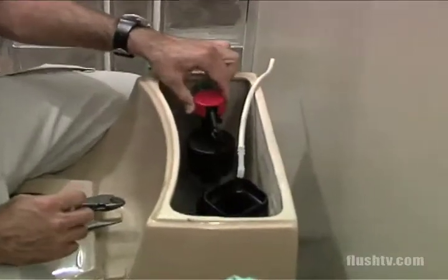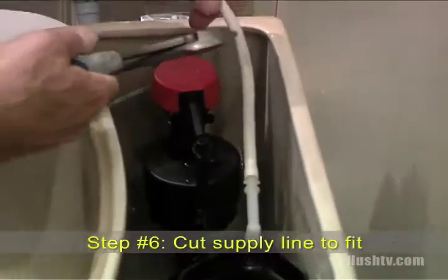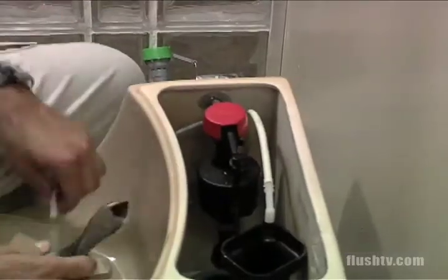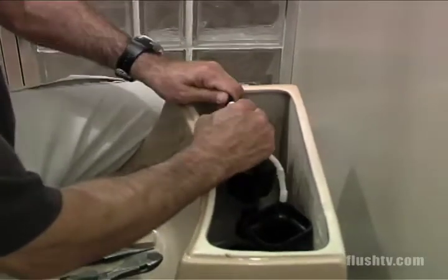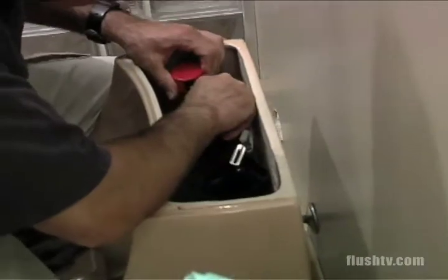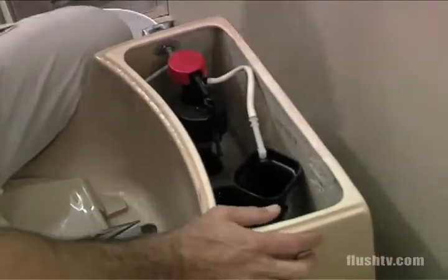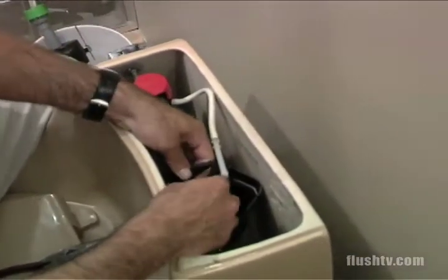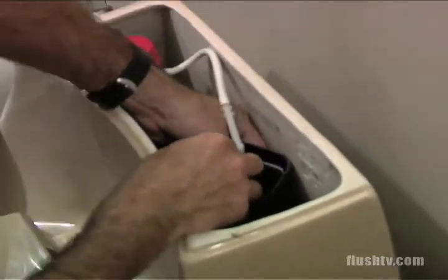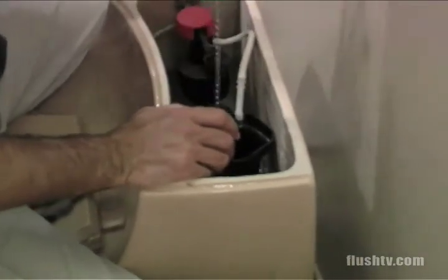Here's our new fluid level control valve — it's set up and now we have to tweak the installation and do final adjustments. We're going to take the supply line and cut it with our side cutters. On this model we have a little insert we put in and clip to the fluid level valve. Now we're going to take our flapper assembly — that's going to seal water into the tank. There are two little ears on the side of the flush valve that we hook these little tabs on. The flapper is hooked onto the flush valve, both ears are caught, and it seems to be seating properly.